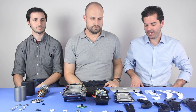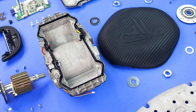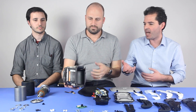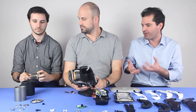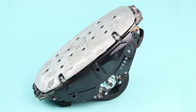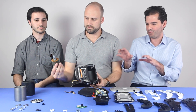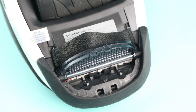So we've completed the teardown of the Segway Drift W1 e-skates. At the beginning of this, we had three questions we wanted to answer. The first was about the weight limit. At first we thought it was related to the strength of materials and design, then we thought maybe the hub motor — which takes all the weight — might deflect and not operate properly. But very late in the teardown, Trevor noted there's also a slope limit: at a certain point, the motor is just not going to be strong enough to carry somebody up a hill. Structurally it's very solid — we don't think any of these parts are going to break because of the weight. At a certain point the motor's just not strong enough, and obviously that's a design trade-off. While it is limited by slope, we were also trying to see if this is a robust vehicle or just a flash-in-the-pan holiday toy.